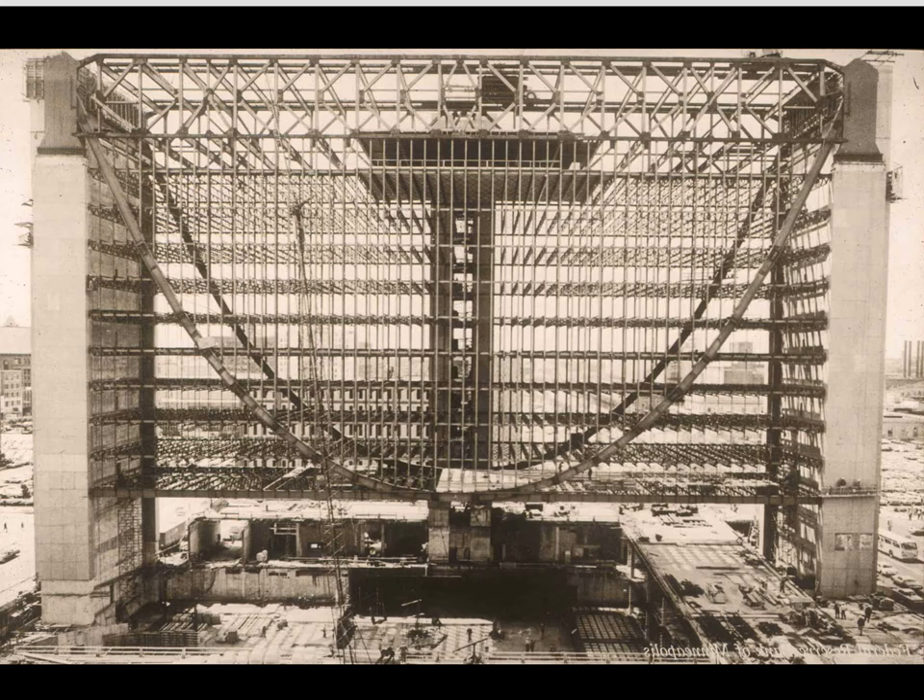There are also approaches that don't make the base narrower but free up urban space. The Federal Reserve Bank building in Minneapolis has two towers with a parabolic suspension element spanning between them — about 300 feet — with no columns anywhere in between. This opens up a really nice plaza at the base. Spanning from one tower to the other are trusses about 70 feet long, so each floor plate is 70 feet wide, and with a little extra ceiling height you could play football on one of these floors without ever running into a column.